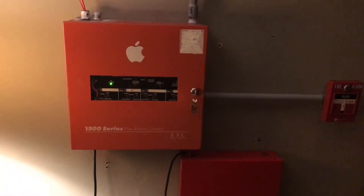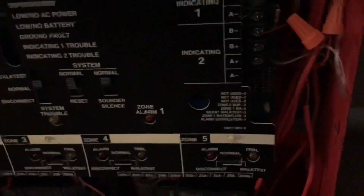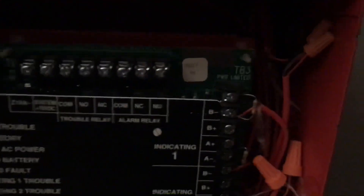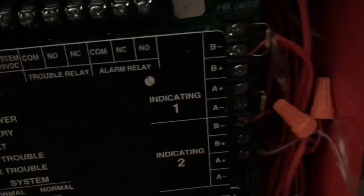I have made some changes to the system. We're going to go ahead and open up the panel. As you can tell, I actually changed the NAC wiring from Class A to Class B. There's also NAC 2 in the circuit, which will be used sometimes, and I'll explain why in a few moments — same with why I swapped over from Class A to Class B.